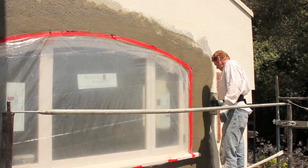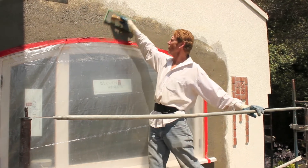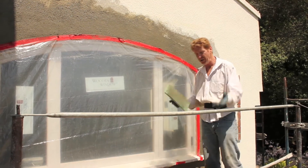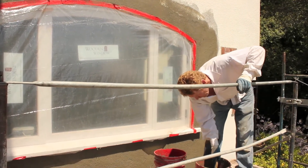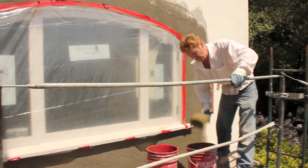This is the first stage for this particular texture — a very, very light dash. As usual we are multitasking, doing several windows. When one window is set we'll come to it; if it's in the sun or the shade, we improvise. Now that I've got that floated out, I'll show you the light dash. This is a dash brush — eight-inch bristles, square.